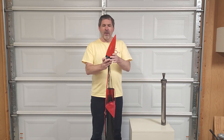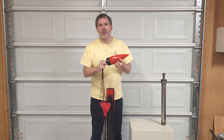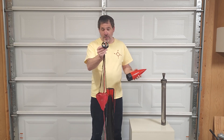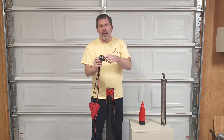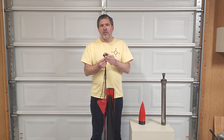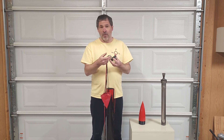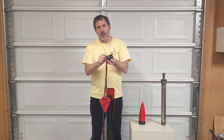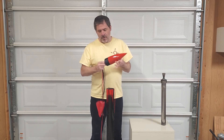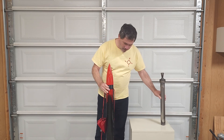Up at the top here we've got a nose cone. At first glance it looks like a regular nose cone, but this is something really special that I designed and we 3D printed. The bottom section threads out, and inside we've got our flight computer — this is the Egg Timer Apogee. This will provide us with a total altitude of our launch. It's also in charge of the ejection charge to deploy our parachute, which sits in a little cup on the bottom. That just gets screwed into the nose cone and we're ready to go.